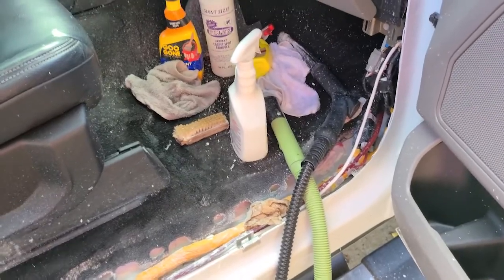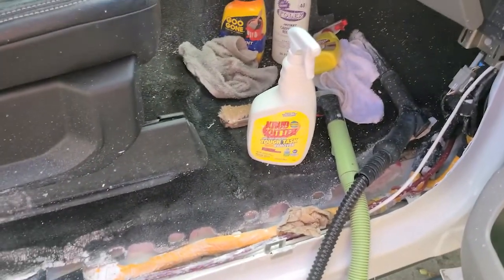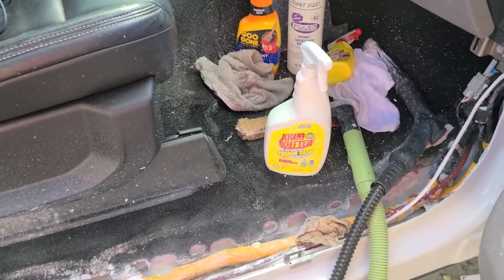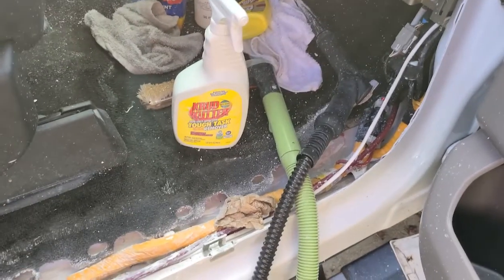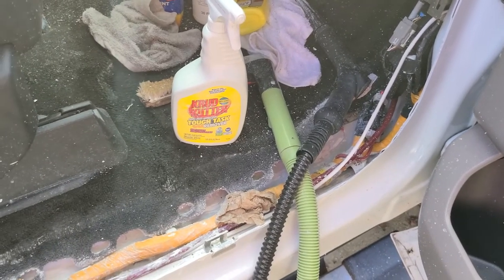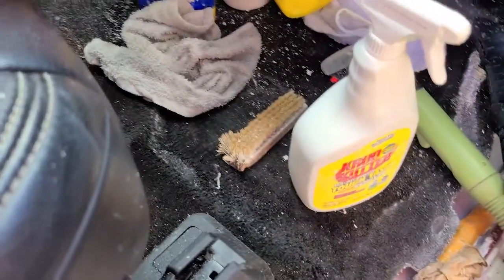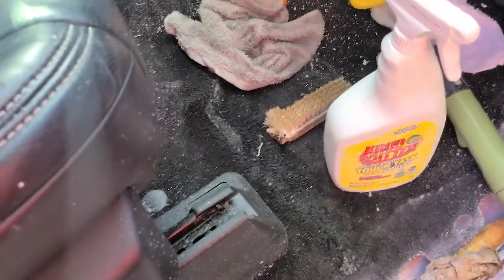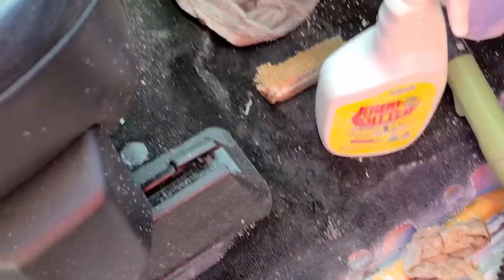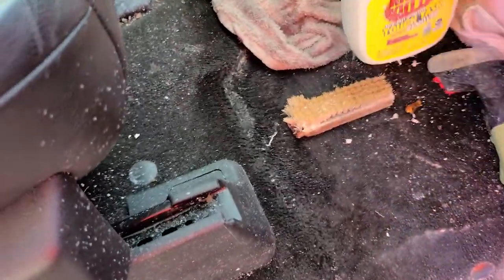It is working. Everything else I had tried before — rags, carpet removers, Goo Gone — absent a really good hot steamer, you're just not going to get it out. So if you get yourself into this situation, number one: keep the paint wet. The only way you're getting this paint out is to get it wet again so it's liquid and you can extract it. There's no way to get it out while it's still solid because it's intertwined with the fiber. Get Saran wrap and cover the spill until you have the right materials, then go in while it's still wet.